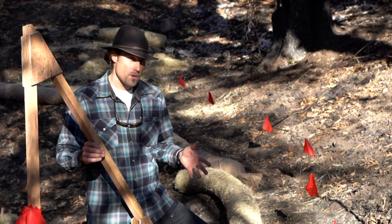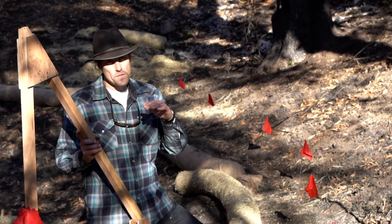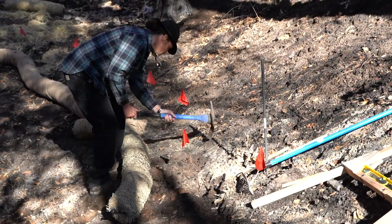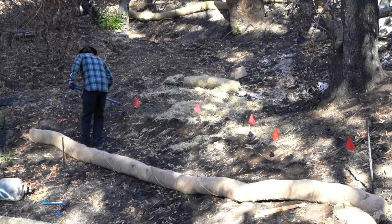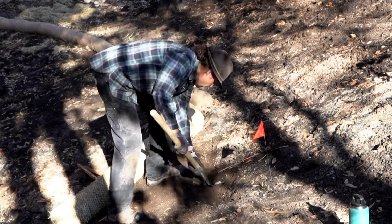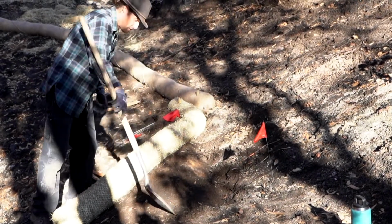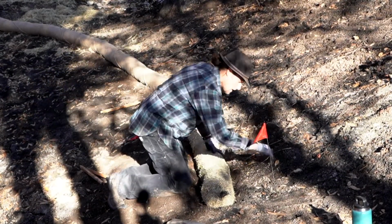One good thing to remember about the wattle is it's not a dam. We're going to want the trench to be about 1/3 of the depth of the wattle. We want to get the soil and shovel it on the uphill slope. And this will just help in general catch some more of those soil particulates as we get that in place.